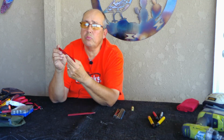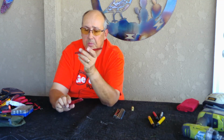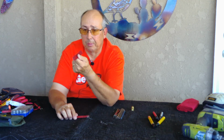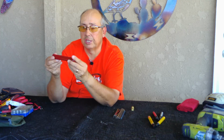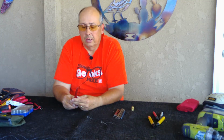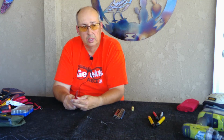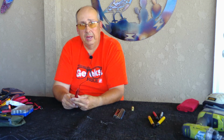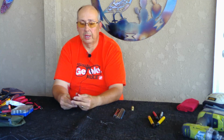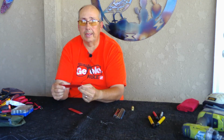So as a result, a buddy of mine who repairs F-18 Hornets has been saving them up for me, and every time I go to the East Coast, he gives me a big box of them. So I've got a bunch of these things laying around, and they're good for a lot of different things. You don't want to scratch the panels on an RV. On the outside specifically, everything is sealed with some sort of sealant. So you've got butyl tape, you've got Sikaflex or some other sealant on there, and you may need to separate that adhesive or that sealant from the coach body. These are great for that because they don't scratch the paint.